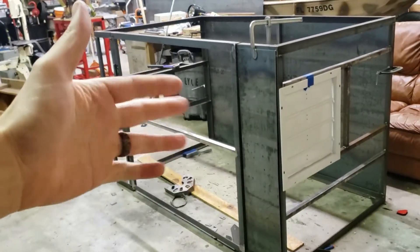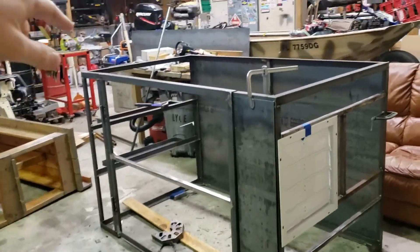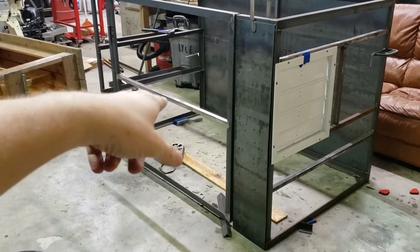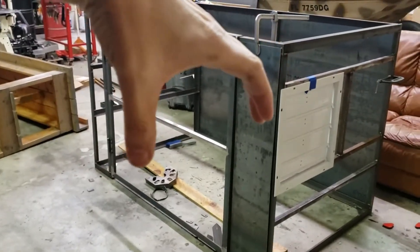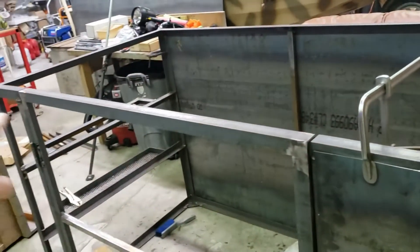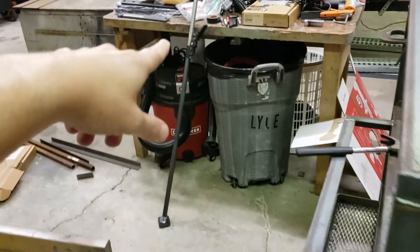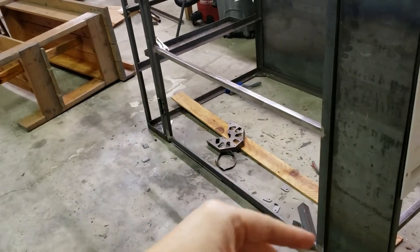When you have distortion or warping, obviously that's going to be impacted by the length of the material. The back piece is solid, the sides are solid, and then there's two little parts here — so it's almost like the form of a C. I believe what happened is when I started welding the corners, basically the C went like this a little bit. There was about an inch difference between this back part and this front part. That's not how it started — that's how I ended. Then I put it in the bed of my truck to kind of block off cargo, and I can put that in here to extend out the front part so the door works.